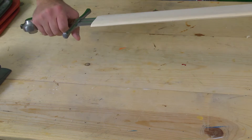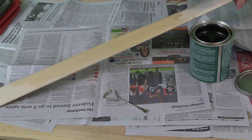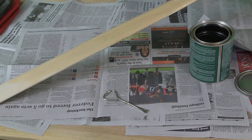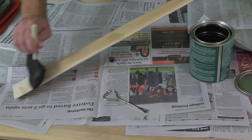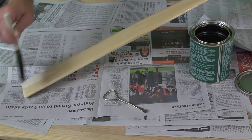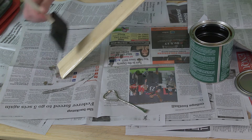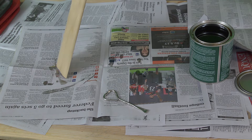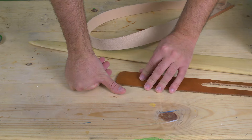We're going to move on to the next step: sealing it and adding some risers. We seal it with a Helmsman spar urethane — you don't have to use that, any varnish will do. As I said in the last video about making scabbards, you want to seal it so that moisture from the leather is not absorbed into the wood, which would cause the leather to crack and look awful. It also provides some water resistance, although you probably won't need it since you have the leather there.